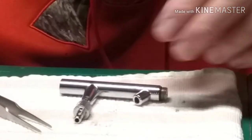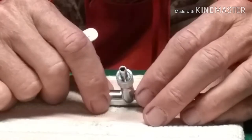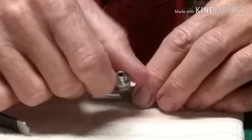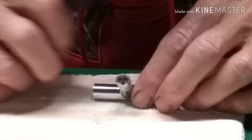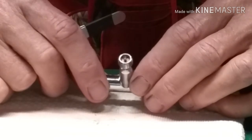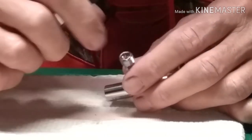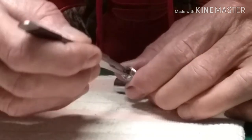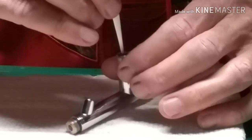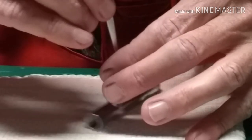Let's go ahead and focus on this air valve. Some of you guys, if you've never had it down this far, you'll be surprised that there is a bit more in there than you probably think. This is just my quick adapter — screws right off. I don't even keep any Teflon tape on it. There is an internal nut with a slot in there — a threaded portion with a piston, plunger, and spring. I'll show you as they come out. I just get my handy tweezers. You want to make sure you keep track of how these come out in order, because it only works one way.